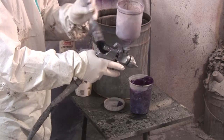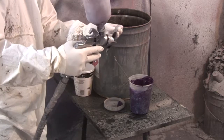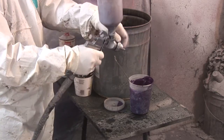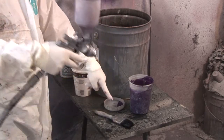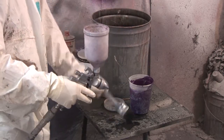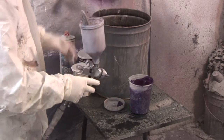I'll clean all the threads and air cap. Here it is with the brush in the cup — it keeps the acetone in. Now I'm taking the paint brush out so you can see the splash. Look at all the acetone that came out — you don't want to get that in your face. So always leave the paint brush inside the paint cup when you're doing that backwash technique.